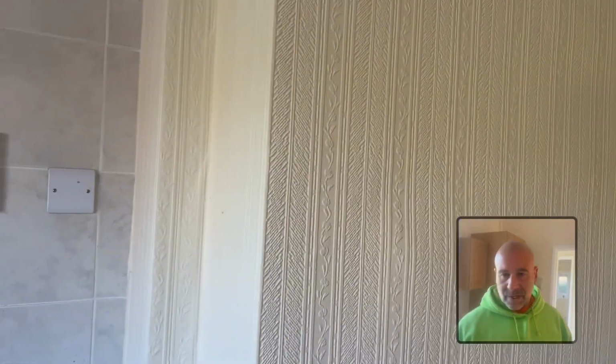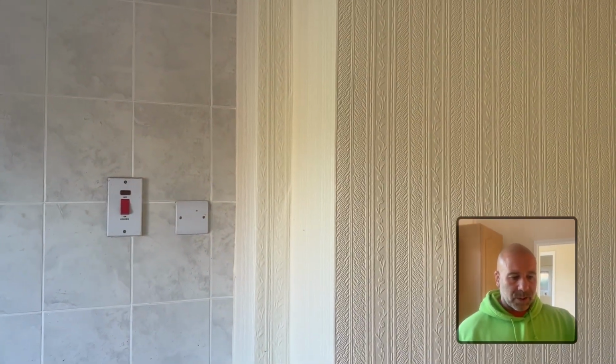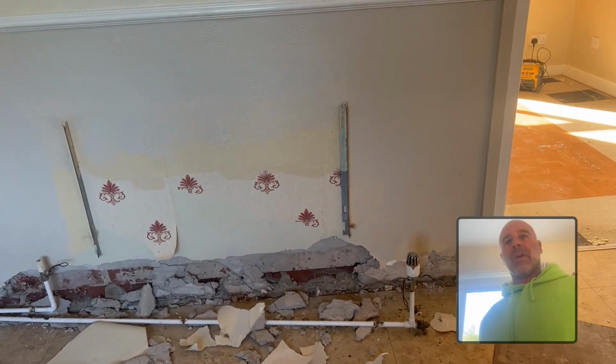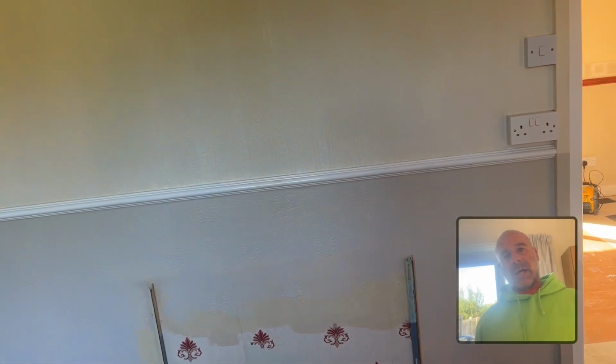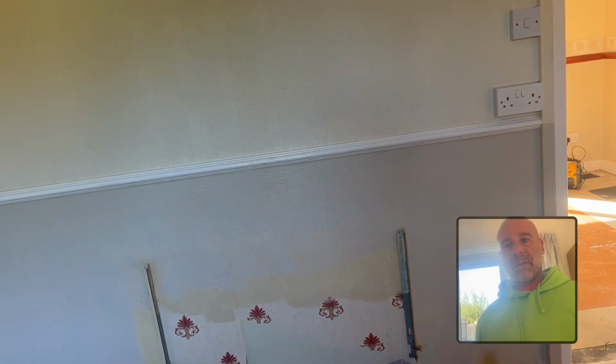Now I don't know whether that's because there's raised floors or concrete floors were of an original DPC, what were poured, so it'd have been a bitumen felt roll or a poured bitumen DPC. Whether when they put floors in, it bridged the original DPC, and then somebody in their wisdom said, right, we're going to cut bricks out and put a new DPC in. And the problem with that is they'll cut a meter's worth of bricks out, and then they put slate in. It's a right fiddly job, and it's not really continuous.